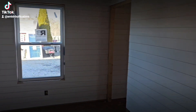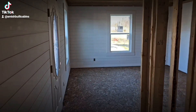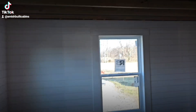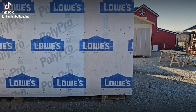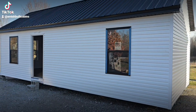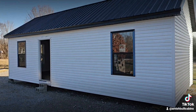And as you can see, your electrical box is going to go back there — you already got the wires coming in. Nice good-sized window in the bedroom. This one is a 14 by 32, one bed one bath — walls are clean as a whistle. We'll have R13 insulation in the walls and R19 in the ceiling.